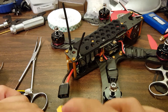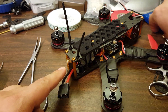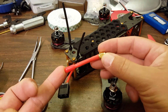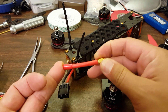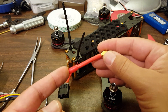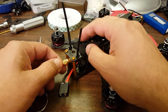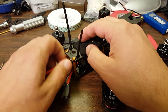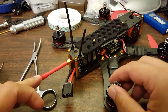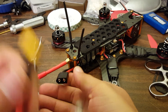But I can't plug it in yet — why can't I plug it in? No antenna here. So I've got this little antenna. Crazy Pony makes these. I haven't tried it in flight yet, but some people say that if you're not flying very far — like if you're just racing and you're not going behind trees — these are much more durable than the circular polarized ones. They don't give you the range, but you don't need it. So I'm just going to stick that on there just as a dummy load, so I don't burn out my video transmitter when I power up.